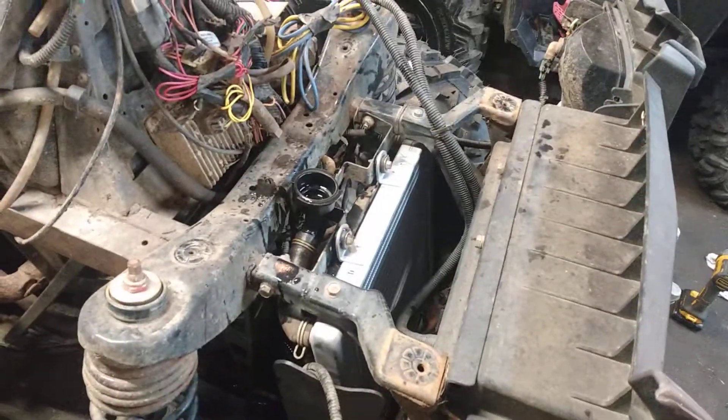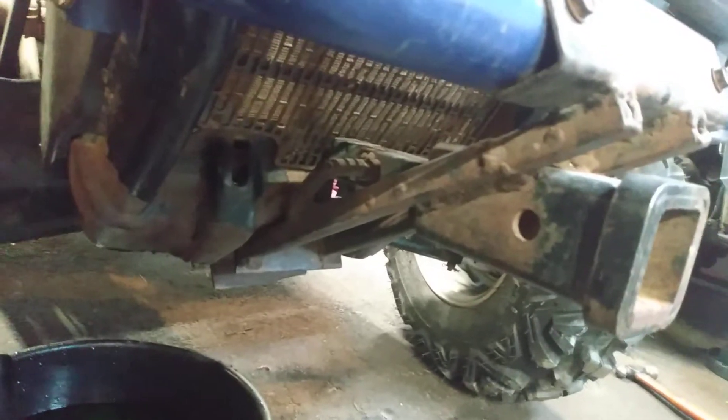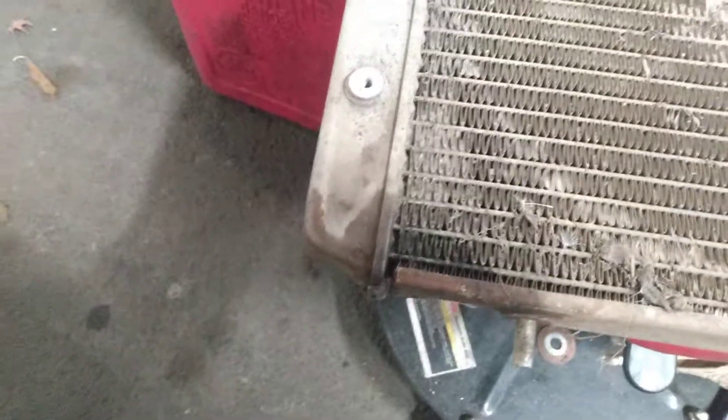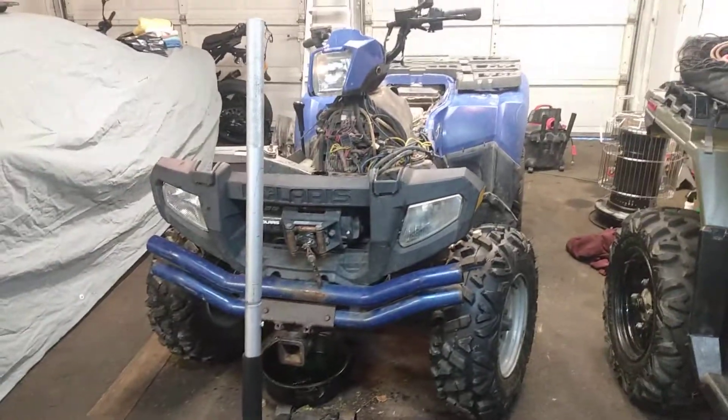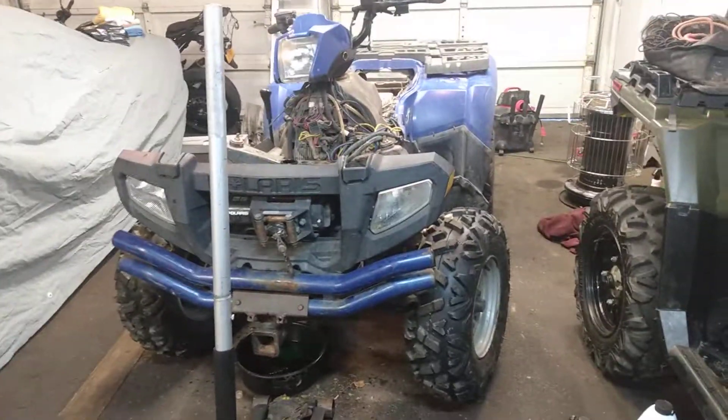Starting at the front — the radiator was cracked. I just got done replacing that, which is fun on these. The reason why it was cracked was because this plow mount, when they put it in, either it isn't for this machine or it's honestly some rigged-up thing. It pushed the front skid plate into the bottom of the radiator, right there, and cracked it. He didn't know about it — his son told him once he got it home. The machine had fresh, brand-new coolant in it; the guy was obviously just topping it off. It was a very minimal leak — once it got hot, the radiator would expand and then it would leak.